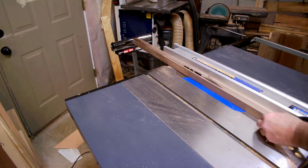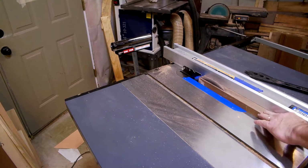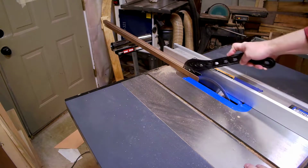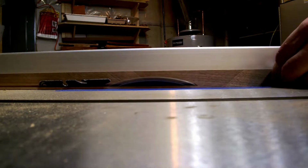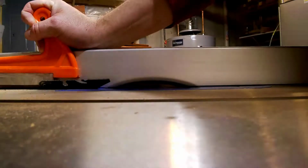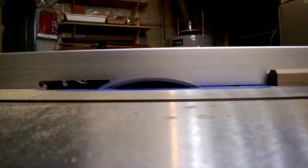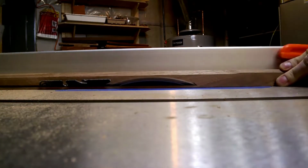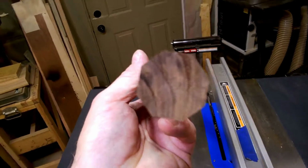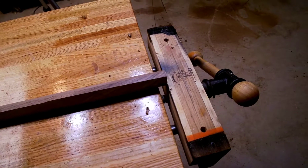So I had some walnut, and I didn't want to use it. It was relatively thick. It was more than 1.5 inches thick, but I wound up cutting a piece off of that and then cutting it down into, again, just about 1 1/16 by 1 1/16 square to give me a working shaft for the cane. And then all I did was turn my blade on 45 degrees, and I took the square edges off this thing because my lathe is a mini lathe. There's no way I could put this shaft on a lathe. I'm going to have to hand finish this and turn it into a round as close to a dowel as I can for the cane. So there it is. All the 45s are cut off, and it's just a nice little octagon. You know, and honestly, it looked pretty good the way it is. I could have used this as a shaft of a cane, but I wanted to round it off.